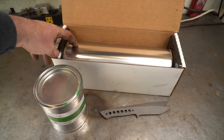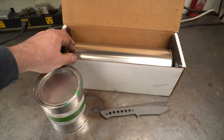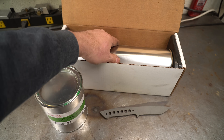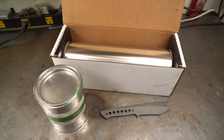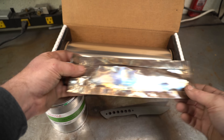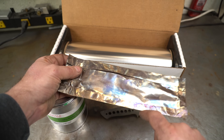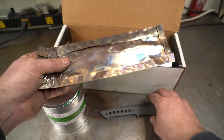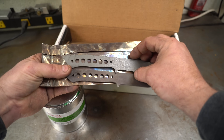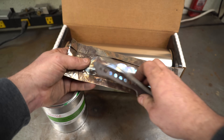The main reason I don't like stainless steel foil is that it's expensive — around a hundred dollars for this roll and it's only 25 feet long. It's also a pain to fold; you're guaranteed to cut yourself because it's really sharp. You have to make these pouches, and sometimes I make them too wide and they don't fit in my quench plates, which are four inches. Sometimes when I do two at once they overlap and when I press them it pinches and racks part of the knife.